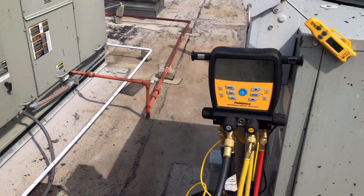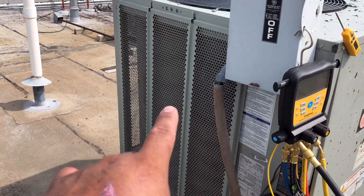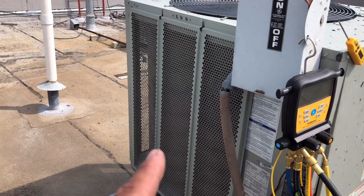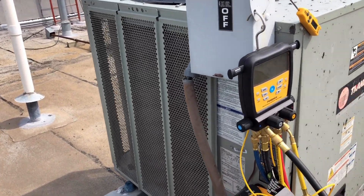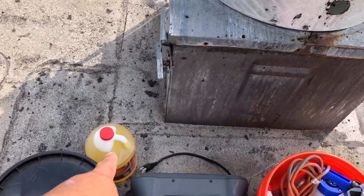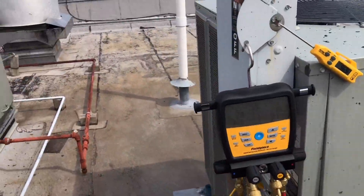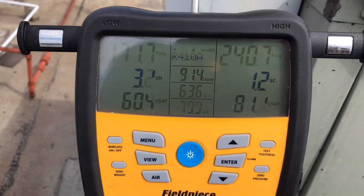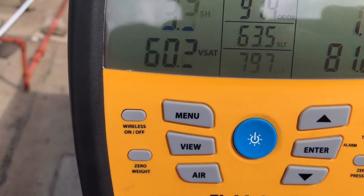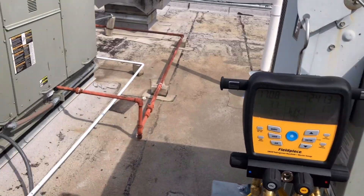I started giving the unit the whole look around. Condenser coil was extremely dirty. Somebody came up and cleaned it — I'm not sure who — but they alleviated that problem for me, because I had already brought up my coil cleaner and coil gun. So we don't have to do that anymore. Our main issue is this thing's just not going to cool. 60 degrees saturated — we're not going to get anything but an 80 degree supply air out of this, if that.